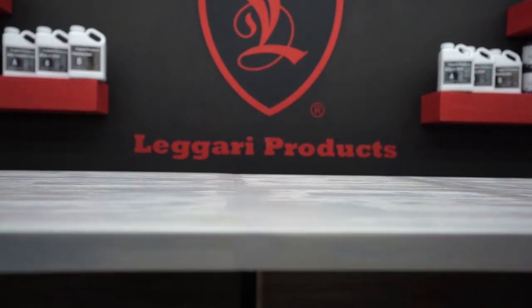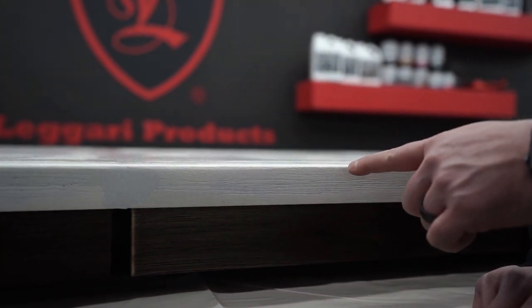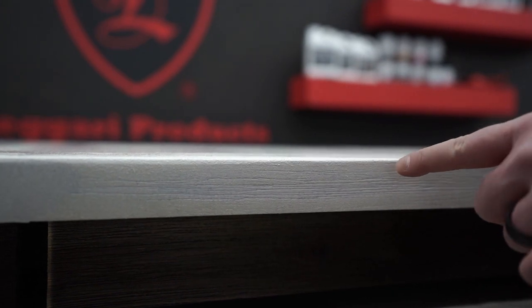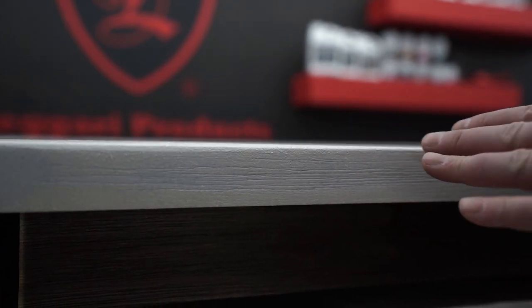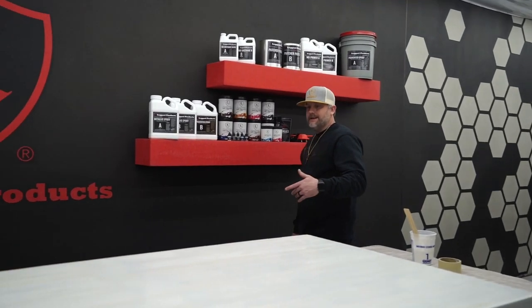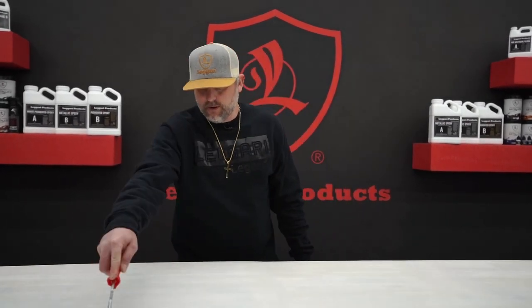And then the other thing, Landon, this is Landon's fault. He sanded this with some really rough sandpaper, so we have a bunch of wood burrs kind of sticking out of here. We want to use like a fine grit so it doesn't chunk up that wood as much. Just a couple pointers for you guys to take note of when you're doing stuff like this. Corners, faces, sand them with a finer grit so it doesn't rough them up as bad and create like a bunch of wood pieces sticking out, little fibers of wood. Any seams that you're filling, overfill them and sand them flush.